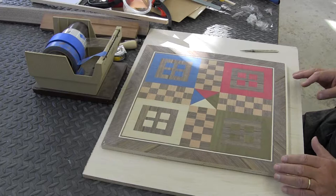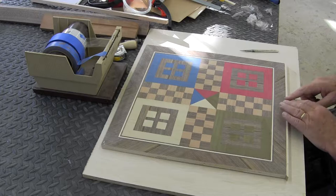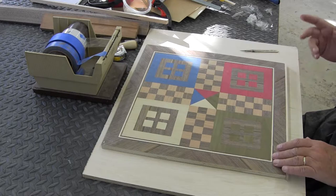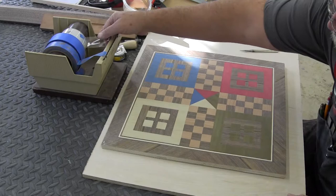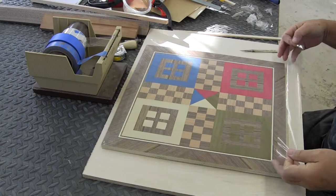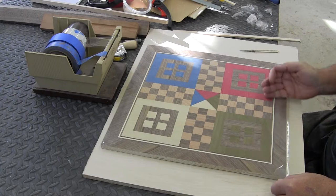The problem I have is I need to use white glue to glue this to the substrate, and I'll probably use pin nails, but I don't want to smush glue all over this pristine veneer. What I've found that works really well — it's kind of tedious but it works very, very well — is to take packing tape. I've already protected three of the four edges. I'm just going to take this tape and leave some of it overhanging both on the ends as well as across the side here, and set it really good.